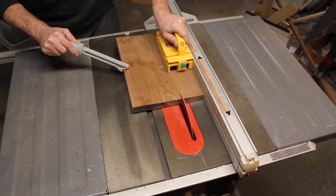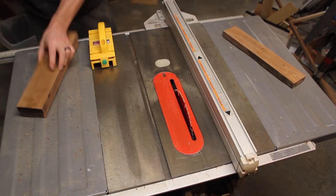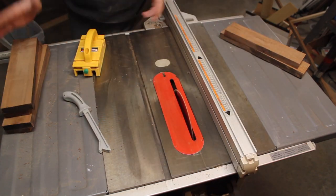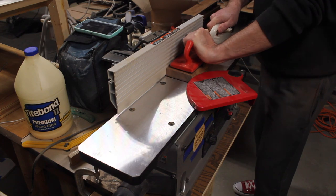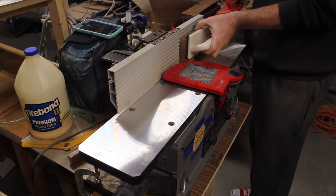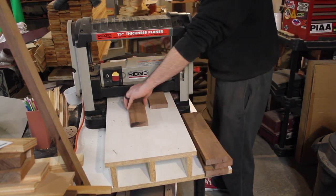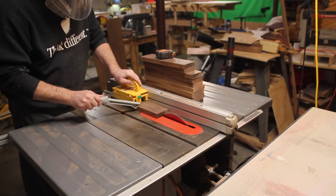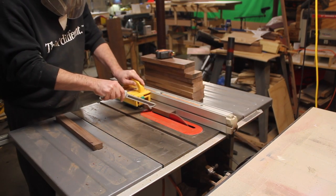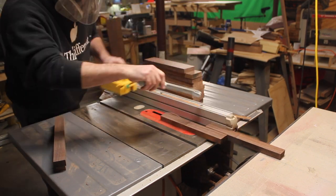You build it like a cutting board. I'm cutting things down into strips, and that piece was awkward for some reason. I continue this process until everything's the same width. I square up two edges on the jointer — now both those edges are 90 degrees to each other. Over on the surface planer, I get the top side parallel with the bottom. And then the table saw is the last edge — now they are completely 90 degrees. As you can see, cutting boards require a lot of cutting. Even though this will be trim, still the same — lots of cuts.